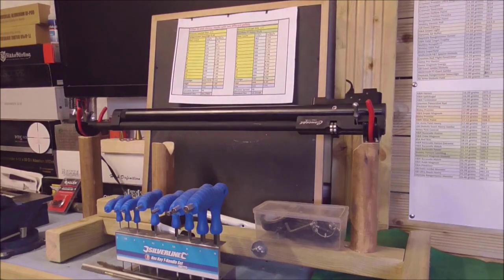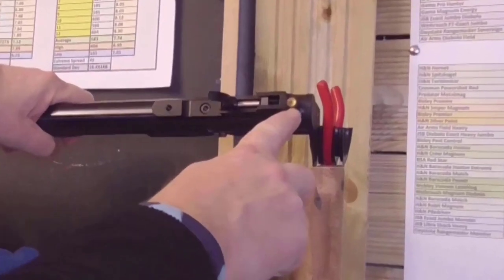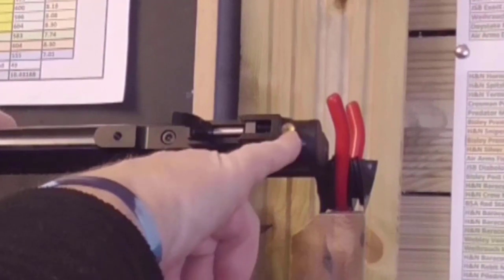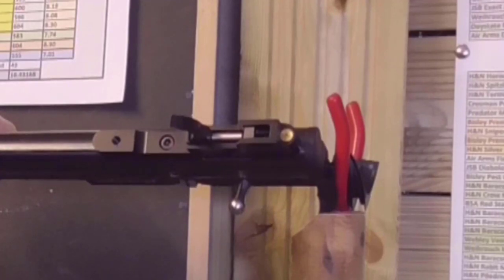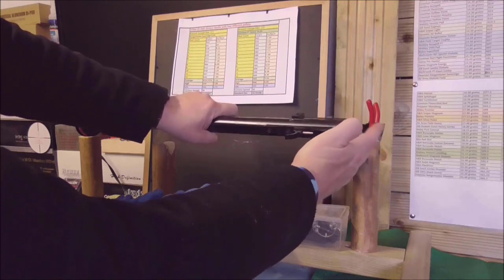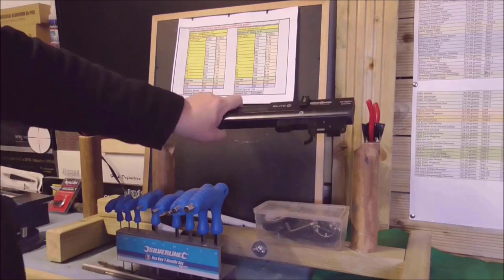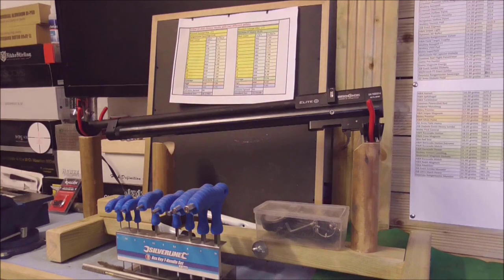So now I can see I've got the rifle and cylinder, and the only anti-tamper on these is a little brass cap at the back there. Now, looking at it, somebody has already done a punch hole in it. So what you basically do, you drill through that, you take the cap out so you can get to the Allen screw. So you've got an Allen screw under there and an Allen screw there. That way you get the block out, making sure you're keeping pressure on the back plate, so that's under tension, so when that comes out, that back will come off. But what I need to do now is make sure that it's totally empty of any air. So that'll be my next part of the video.